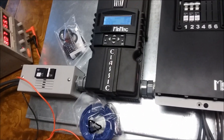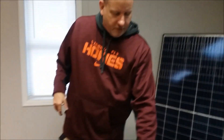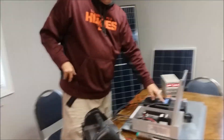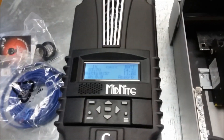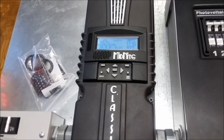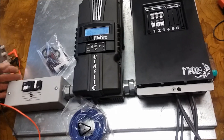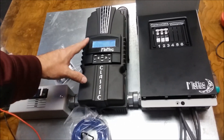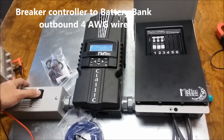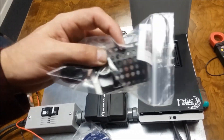This battery has already moved over from the bulk state to the absorb state — that quick — so we're putting 157 watts in from this 60 volt, 3 amp power supply. Here's your off breaker. We're at 14.3 volts on the battery reading from my little solar generator. One of the important things incorporated in our OTG board is a 100 amp breaker — a 96 amp controller with a 100 amp double-throw breaker to the controller. The watts went down to zero there.